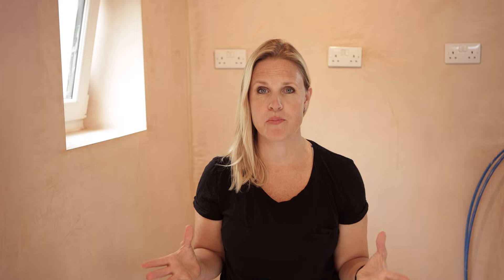The really great news is that if you want fast, easy results when painting fresh plaster, these days you actually don't have to do a mist coat. There are new products on the market, like this bare plaster paint from Screwfix — no affiliation — and other similar products, that are designed to be painted straight onto bare plaster. They dry within three hours, so you can put a second coat on in the same day, and they can also be used as your finished paint, so a couple of coats and the job's done.